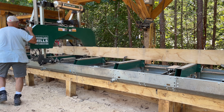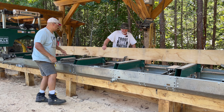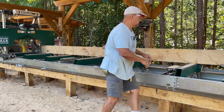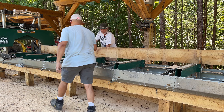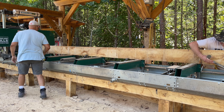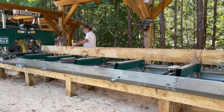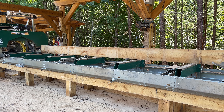Now to get the premium piece out of this board, we actually need to flip it. Now we know we're already straight, so the next piece... We both try to give it a clip, work together. We're not stacking them up — we're trying to get the premiums out of here. Right now I'm going to tell Jay we've got a little bark issue going on here. I'm going to tell Jay to cut me at eight and a half. At eight and a half, he's going to straighten out the board and get rid of the little piece.